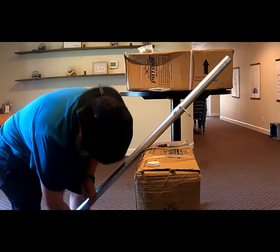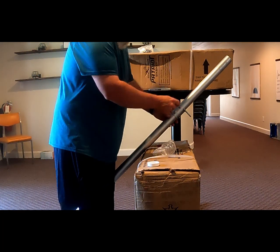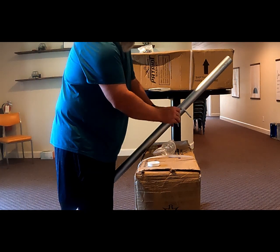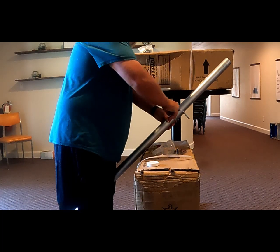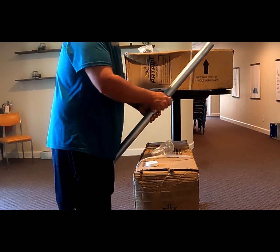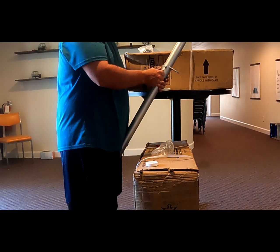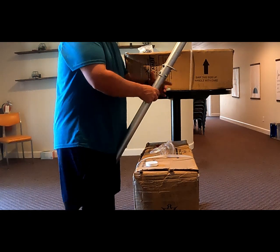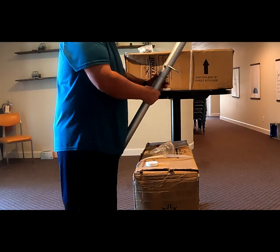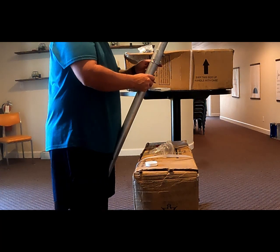May have one there. So I used my other Allen wrench. I thought I had put it in my pocket the other day. So you work this in, get this good and tight. And once that set screw's good and tight, you'll see that stops wiggling. And it's kind of a preventative maintenance also, that every so often you may want to go out, especially if you didn't use the Loctite, to check that these set screws and things have not backed out.